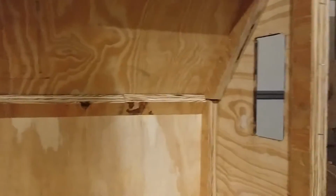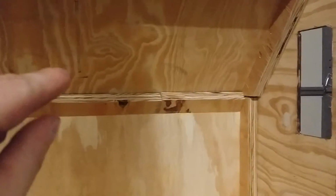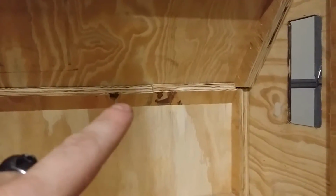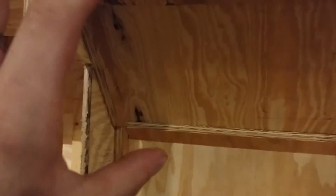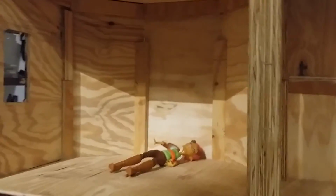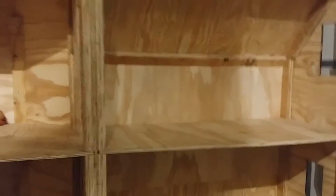So like for this rail, I did a strip with a 45 degree rip into there, glued it into the joint, I think I stapled it in there somehow, but I definitely pneumatic nailed it and called it a day. Nail it up, make it nice and straight, put the next panel on, nail that panel down, and keep moving. So, you know, that's a pretty easy process.